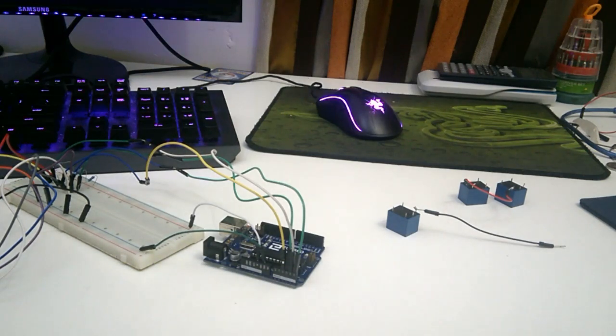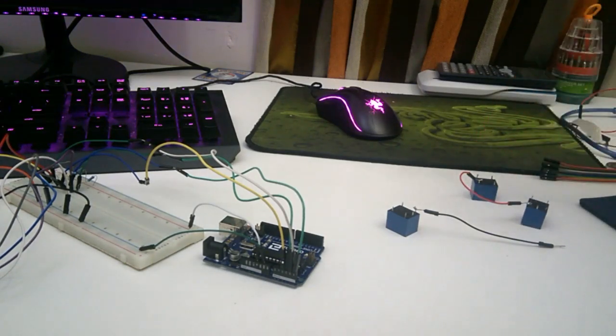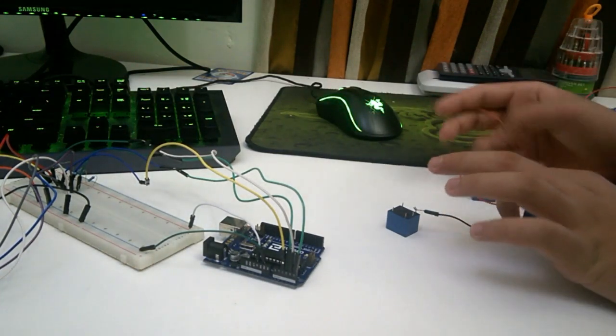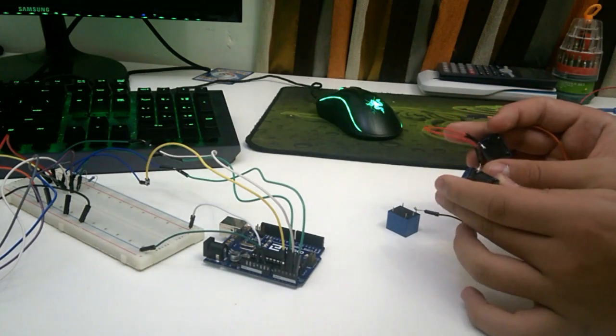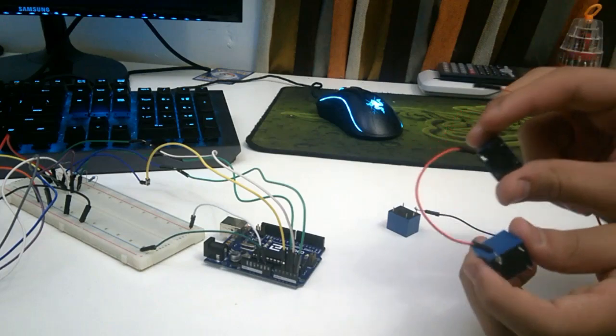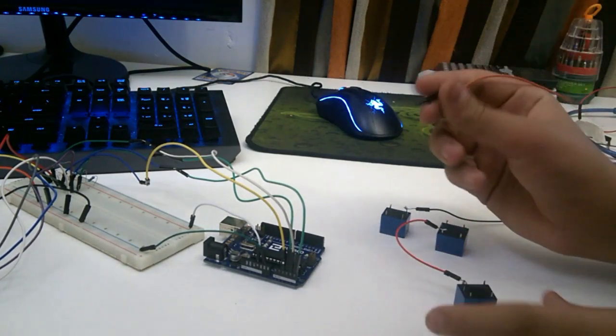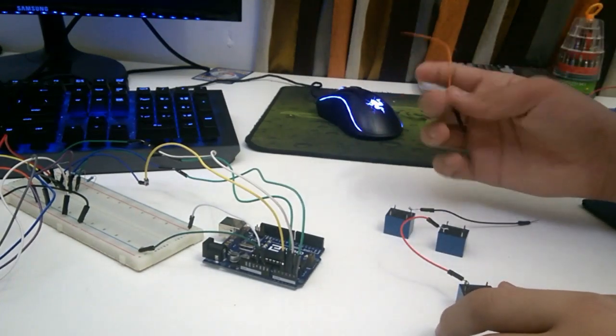So basically, we need to connect the relays together to add the power together while not having separate pins, so it wouldn't use so much space. As seen here, the side where it has 3 pins on the back is the specific side that we're going to use, so it transfers the voltage. We already have 2 set up that I've soldered.